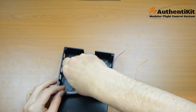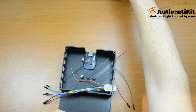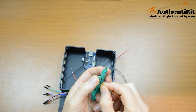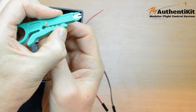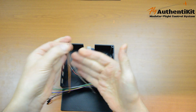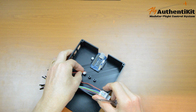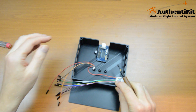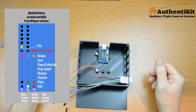So it's another one of these flange head screws. Now we need to strip some wire off these, and I found the easiest way for this is one of these cheap wire strippers. They're quite thin wires, and I find this works better than my more expensive one. You put the wire through the smallest hole, grip it tightly, and just give this cable a little twist and pull it off like that. Now let's twist all these reds together and loop them round this peg. Okay, check that that's nice and secure. And now we simply plug them in.